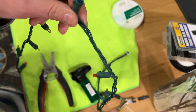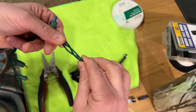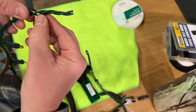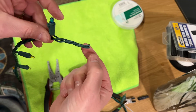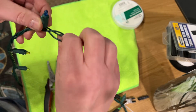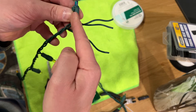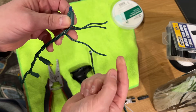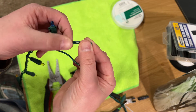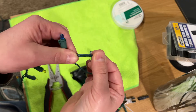Let's decide we want to cut it off in between these two lights. You can see there are three wires there. We're going to go ahead and cut that. Now instead of just terminating all three wires, we have to determine which wires are coming from where. If we untwist them a little, we can see one wire never goes to this bulb. We're going to terminate that wire by itself, then connect the other two wires together to close the path — close the circuit.